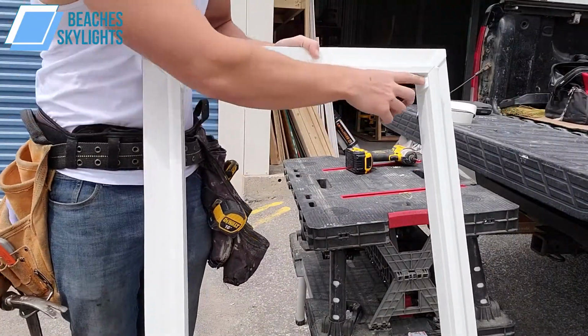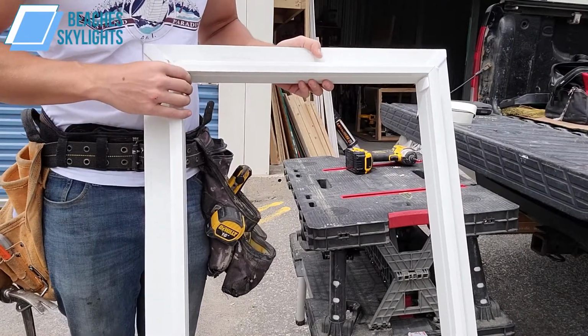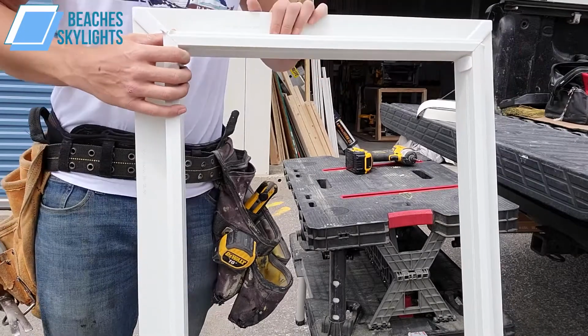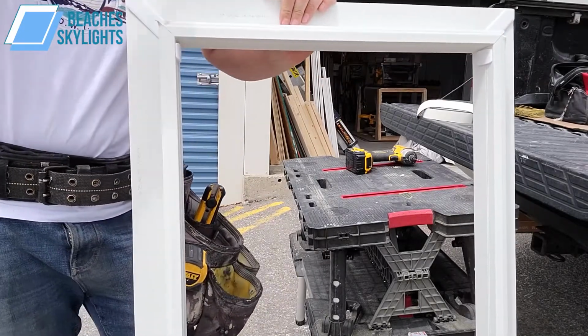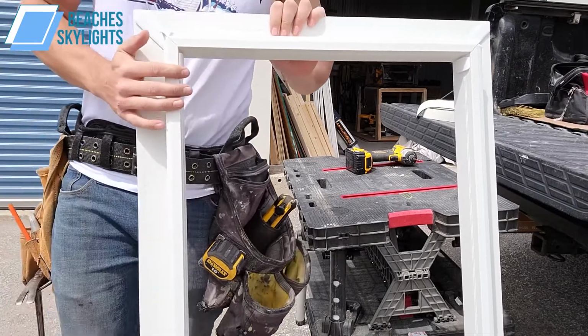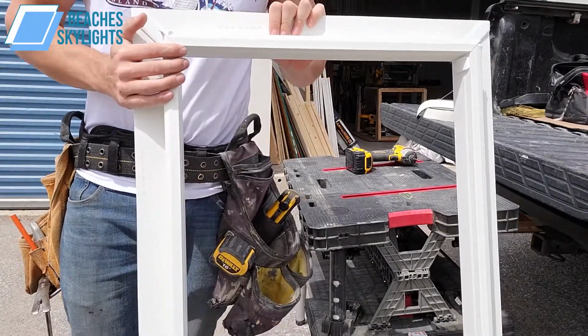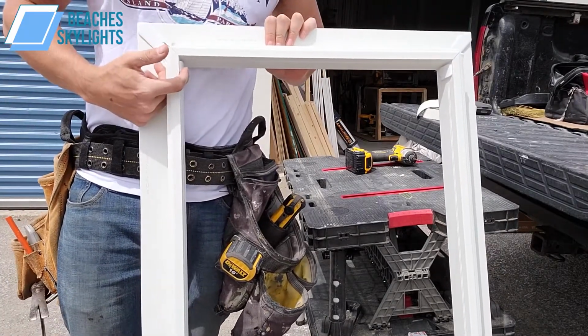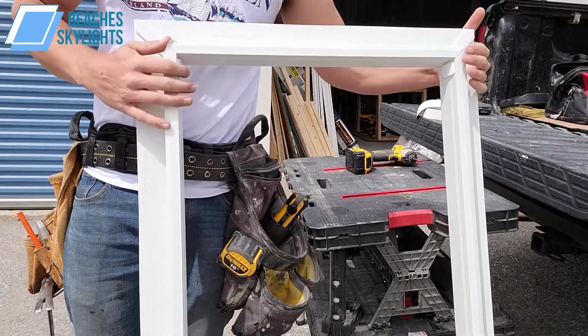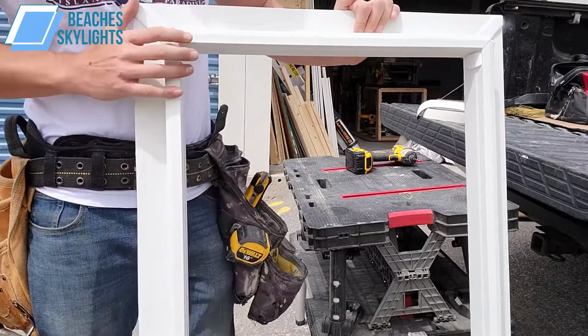here. So the blind motor and function is actually gonna be installed to these clips up here. That's what these are for. And most deck mounted skylights just come with these pre-installed. So because we're doing a curb mounted skylight, we need this tray basically for these clips is what it is. It's just housing. This is the housing for the blind, right?